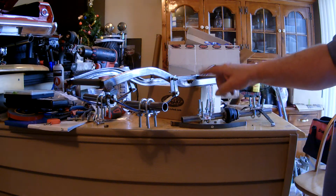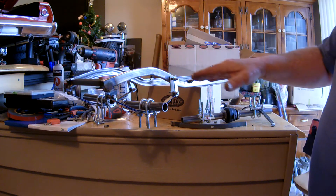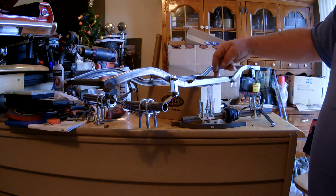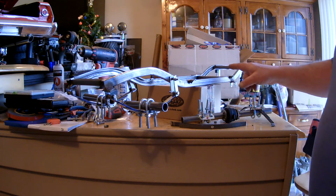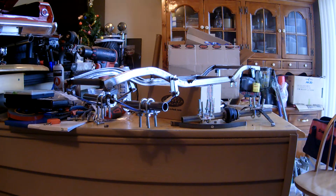But like I say, the frame was just a solid piece of square tubing, and I bent the whole piece together, found my center line, and cut both pieces in half right down the center, top and bottom, and I have two C-channel frame rails now. And the mounts and all this stuff I welded on, my cross members I welded in, and like I say, this is where it starts. I don't know, I did buy a roll of aluminum.